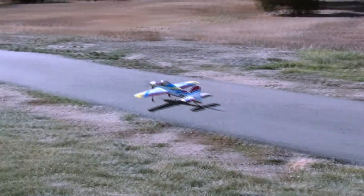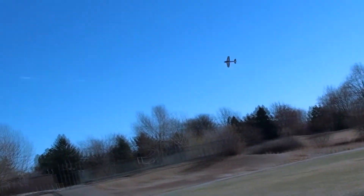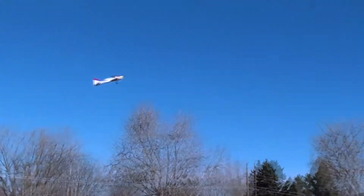That said, the proof was that the 6.5 minutes of flight was acceptable, though you did notice a bit less power toward the last part of the flight. There is some comfort in knowing that the pack won't crash but will taper off, letting you have a couple of goes at landing. I noticed that the cells needed more cooling than the lithium batteries, and a flat pack with open spaces near the air intake was going to be necessary.